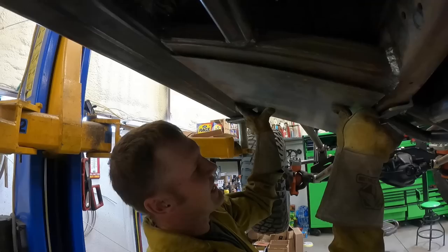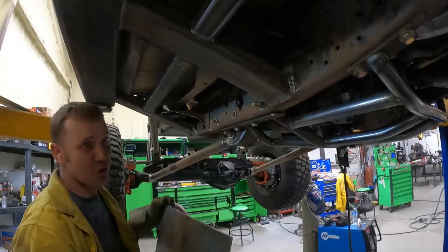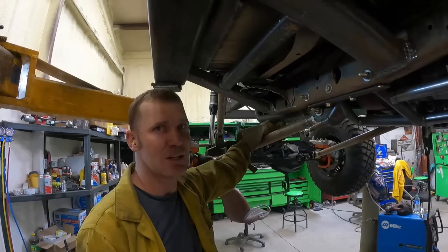That should hang together. You look pretty sexy! How are you going to mark those? I'll probably just cut some chunks of pipe - we'll weld them on the frame and then notch a hole through here to stick them through, cut them off on the angle we want, and weld them back in. We're making this up as we go - making it up on the fly - but I think it's going to turn out pretty good.